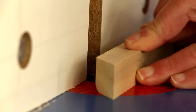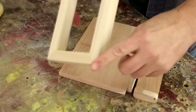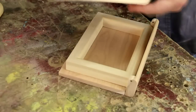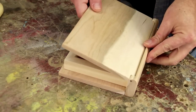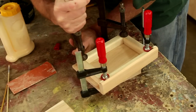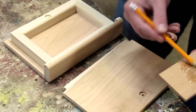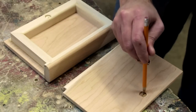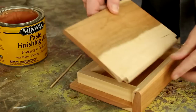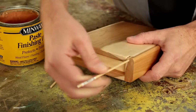I'm making a simple frame out of poplar for the inside box. I made a chamfer along the back edge — it goes up against the spine so that the front cover can swing. I'm going to glue the frame onto the back cover and to the spine. I'm also installing some rare earth magnets as latches — a little bit of epoxy will hold those in. I'm not going to glue the dowels in, but I'll put a dab of paste wax on them so they'll turn a little easier.